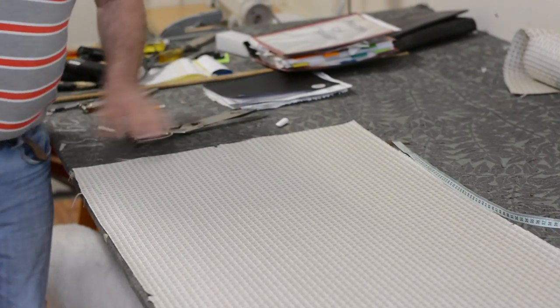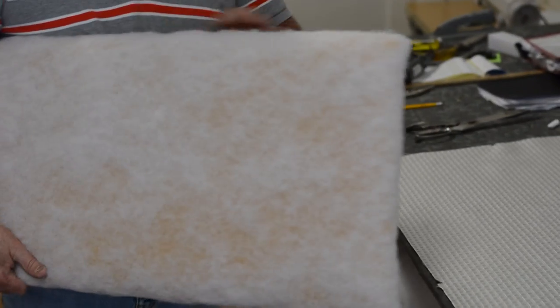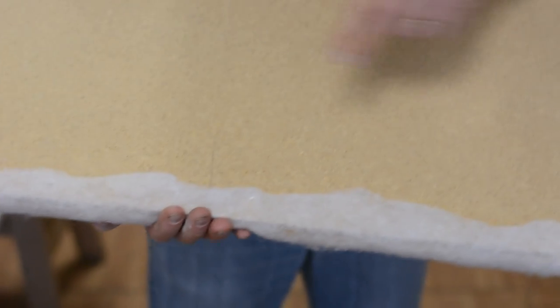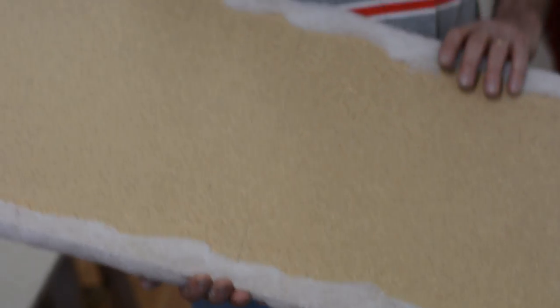Okay, I want to show you what I've already done to the piano bench. We're just recovering this. We have two ways we upholster: we restore, meaning we take all the foam off and put new foam on — or, if the foam is in really good shape, we do a little Dacron work. We put a half-layer of Dacron on by hand and then recover it. That reflects in the cost of a piece of furniture. I've already marked the center points, as you can see.